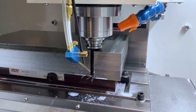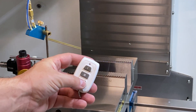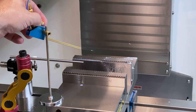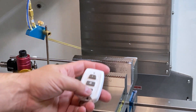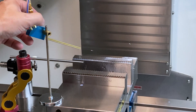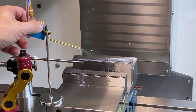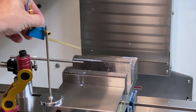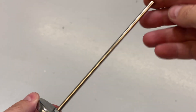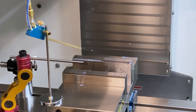Positions like this, running down in a groove very close to the cutter, are very common — this is a static line. A lot of times when you have flood coolant on one side of your part and it won't evacuate chips on the other side, something like this Fog Buster running with just air is really useful. Flood coolant does a good job of cooling the cut but doesn't do a great job of washing away chips, so this little magnetic stand from Hench Manufacturing comes in really useful.